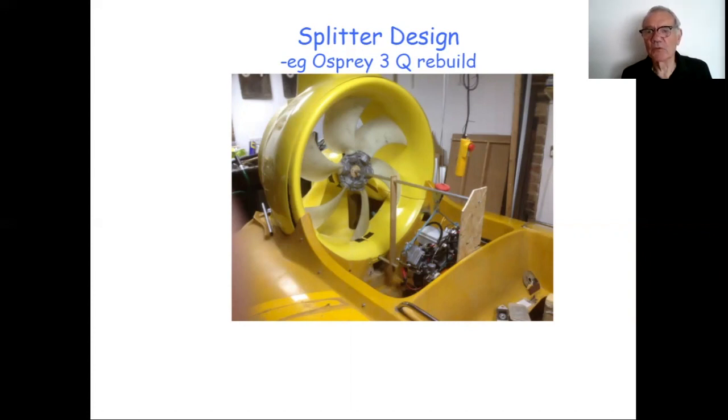And essentially it will fit a thrust unit and a lift unit, integrated unit, that is very similar to the one that was developed on Q1. You can see there the engine. In this case, it's an uprated engine. It's a 50 horsepower version of the Briggs & Stratton engine. Same fan, however, slightly up pitched. It's a rear drive setup.